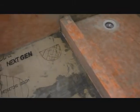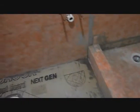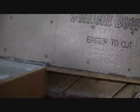It's not hard work, but it just takes time. I cleaned out the floor here, as you can see, and I caulked up the edges with silicone caulk from over here, there. Then I cut a board here, a piece of plywood. Screwed it in, put more caulk, caulk there, caulk. And it's watertight where the Kerdi cloth on the curb is.